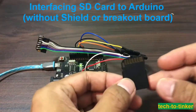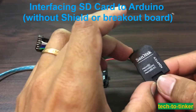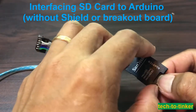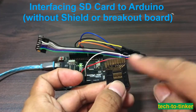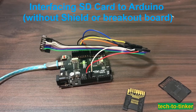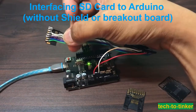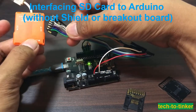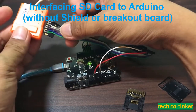So if this is your SD card, you need to force it open. This one is a converter — micro SD card to SD card. You need to expose these pins so that you may be able to solder. I suggest making the connection from inside so that you can still connect it to a card reader if you have one.